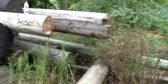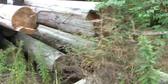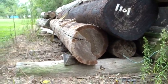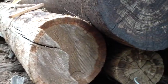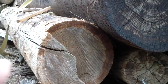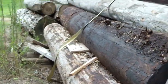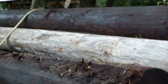You've got to look and make sure they're not just absolutely completely junk and split. Some of them will have splits — that one's got a small split in it, but it doesn't go very far down through the wood. We would start with that split being horizontal on the mill and try to do our first cuts with the split so that you can cut it out as you get closer to the middle and only lose a board or two.